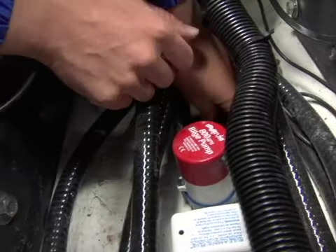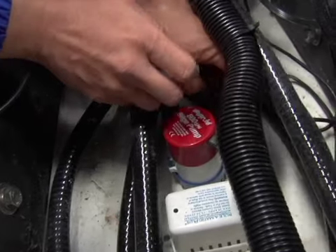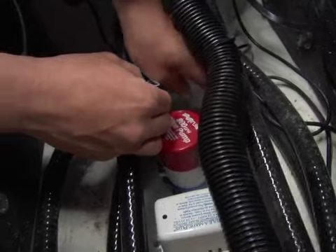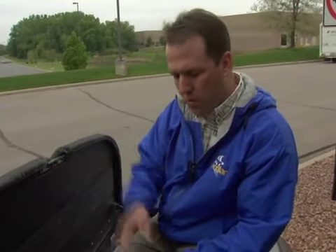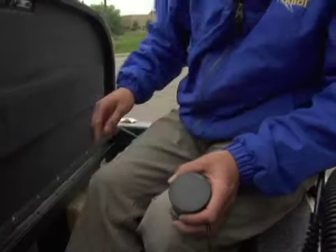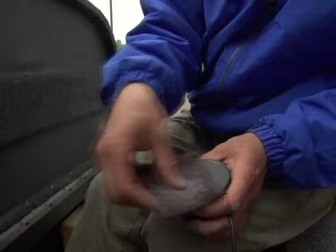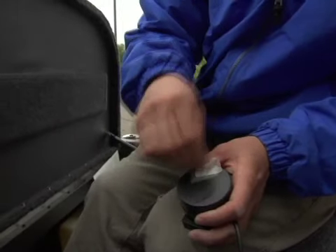Not all boats will have this difficulty, but it will be very beneficial to get this hard work done. Now I'm going to use this alcohol swab to clean this area up. It's real important that we clean up the residue and any fiberglass that might be left on top. One of the key aspects when mounting a transducer in-hull is taking time for preparation. This particular boat took about 25 minutes — it might only take you five minutes on your boat. Every boat is different. Now we're going to prepare the transducer. We take this Brillo pad and scuff the bottom of the transducer just like so. Then it's critical that we clean up any debris with the alcohol swab.